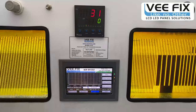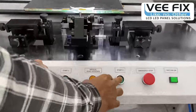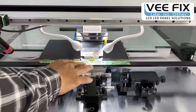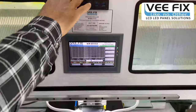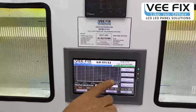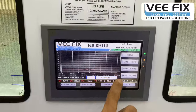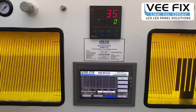Now we can see one bonding profile in action. I am giving the bonding command by pressing start 1 and start 2 together. You can see the 170-degree temperature as the head tool comes down and the bonding process begins. The target temperature is 240 degrees and the present temperature matches at 240 — very precise temperature control, as shown by the stable graph. After bonding, the head is cooled by airflow and the bonding cycle is completed.